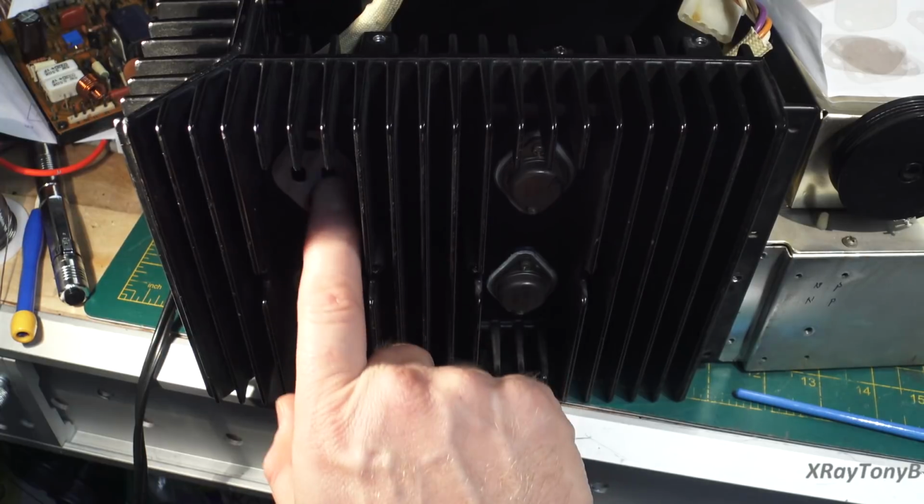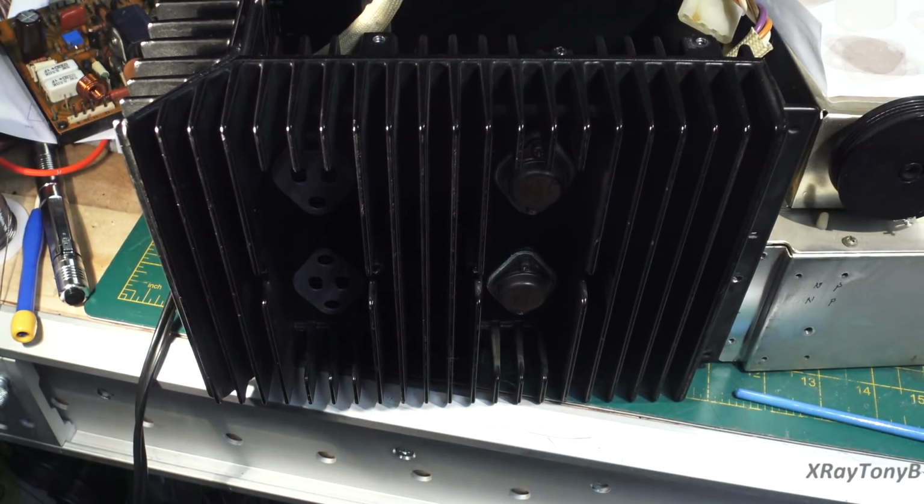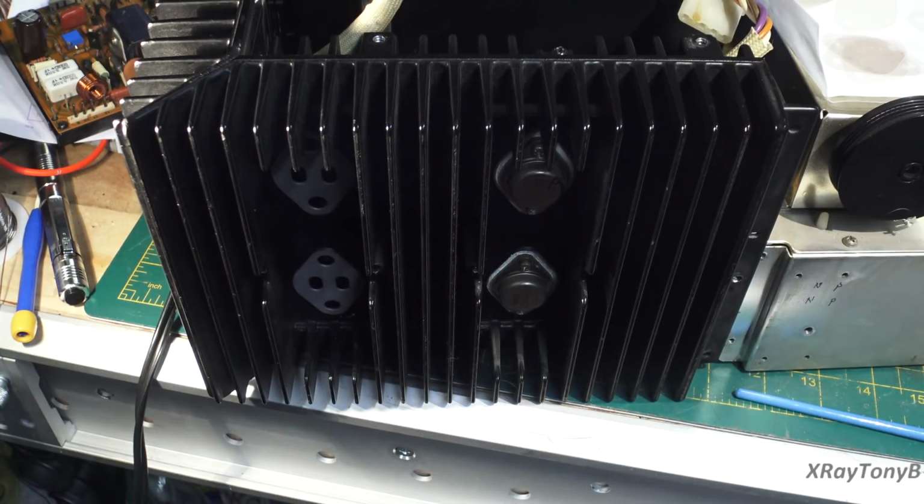And this isn't a mirror polished finish. So this is not something that I would probably use the silicone rubber insulators on, but rather this is the one I would use the traditional thermal paste and the mica insulators. So that's what we're going to do, and I know I did that little video on mounting the transistors, TO-3s, and I know I got a whole bunch of questions: can you actually go through the process and do one on a receiver next time you do one? So that's what we're going to do here, and I'm just going to show you how I go through and do this.